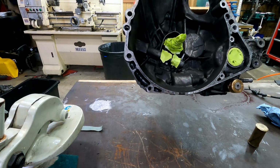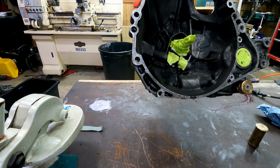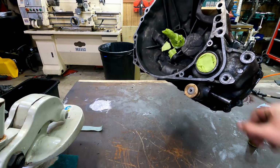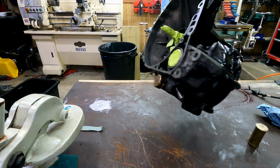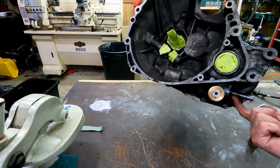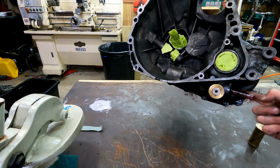You want to make sure that you tape up everything. I need to get some tape on this shifter. Likewise, if you're ever in a pinch and in the last stages of a paint job like that, you can just grease it up too, because paint won't stick to grease. And then you can just wipe it off when you're done.